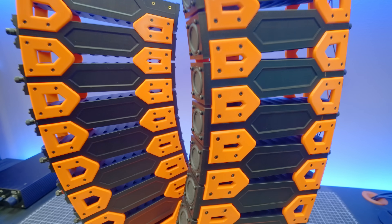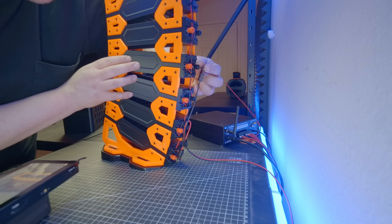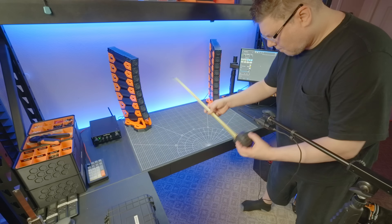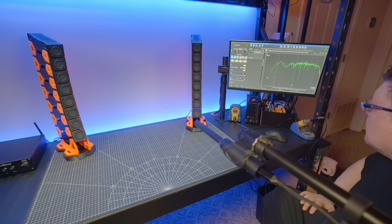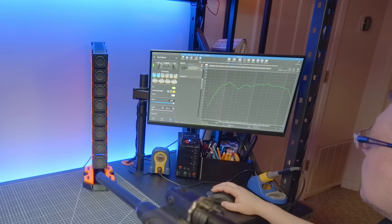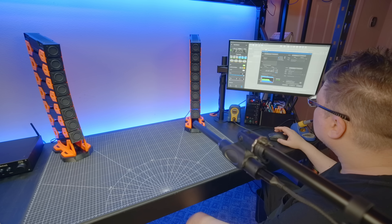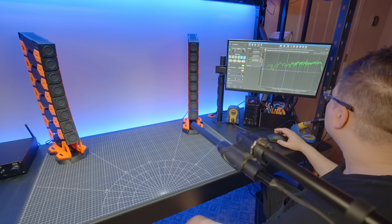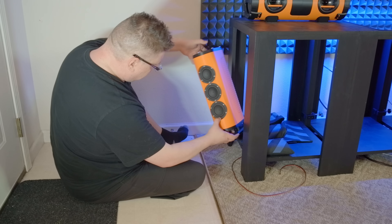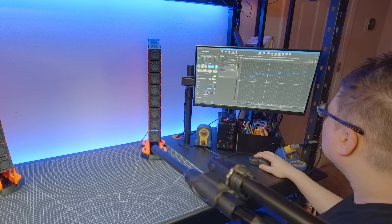The results are ostentatious and unapologetically so. Nevertheless, with everything wired into the amp, the microphone aligned with the focal point, and the DSP cleared out, the initial sweep returns a very close match to the predicted response. This is followed by an 80 Hz high-pass filter and some equalization for a well-controlled extension clear through 18 kHz. Adding a subwoofer — for the time being the Trihexa, delivering somewhat lean coverage from across the way — and there is our tentative frequency response.